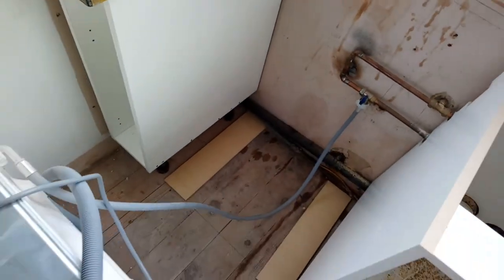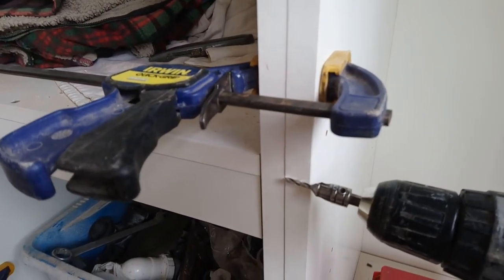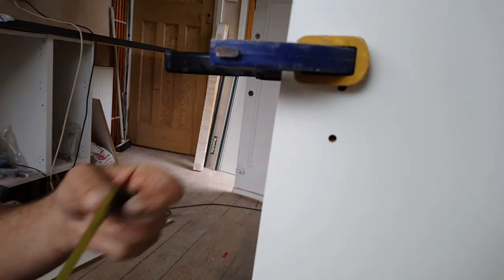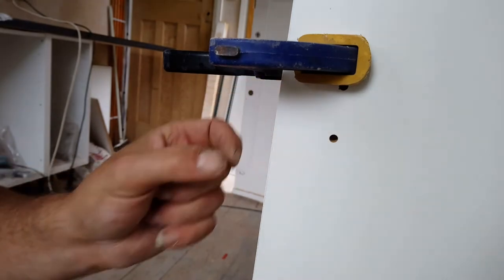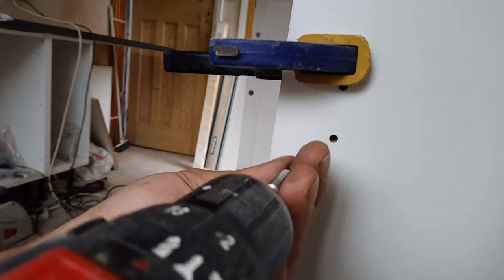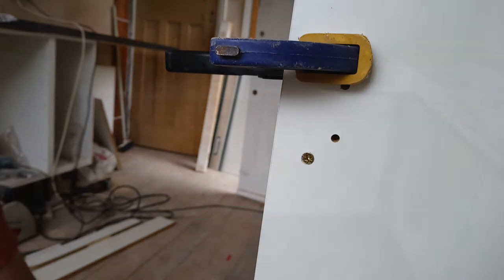It'll maybe even make it easier to slide this thing in and out. I'm screwing these cabinets together — got the front flush and then put a clamp on. I've got the countersink bit set so that the drill bit's just a little bit more than the depth of the cabinet. I'm just using screws for this; these cabinets measure 35mm and these are the 30mm screws. You can get connector bolts but we haven't got any. So what I like to do is drill a hole but don't make the countersink — just pull it flush and the screw makes a nice flat neat finish.